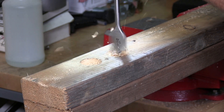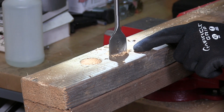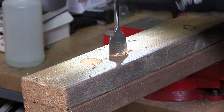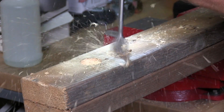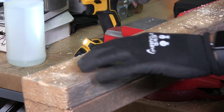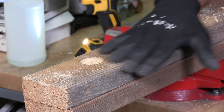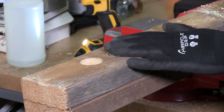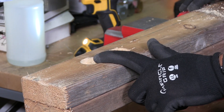I don't want to do that. You can see already just from what I just did how this is chewing away at the wood, which is not what we're looking for. You see how that's jumping around? You can get the countersink done, but it's not precise, it's not clean, it doesn't give you a nice clean finish. So at the end of the day, you really want to drill your countersink first and then your pilot hole.